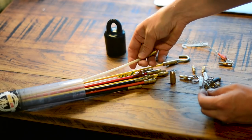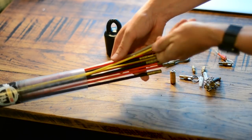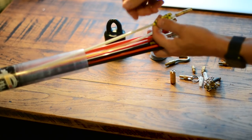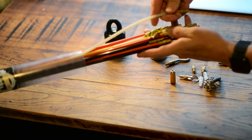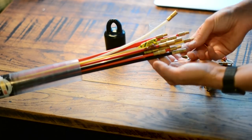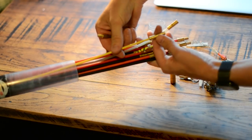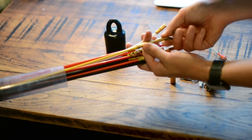The rods themselves come in different sizes - basically different thicknesses and strengths. The yellow is the most thin and flexible, then you've got slightly thicker red ones which are a bit stronger and stiffer, and then the black ones which are really strong and stiff. You've also got two special ones: one is normal thickness but glow-in-the-dark, quite handy for certain situations, and one is nylon so it's really flexible - I use this one very often. Most of the ends have normal male and female connectors, but a couple have a swivel connector, which is handy for situations where you can't turn the rod to screw it onto the accessory - you just turn the swivel and it screws on.